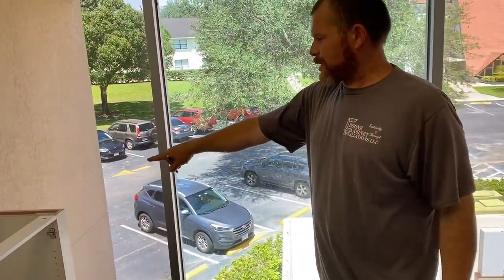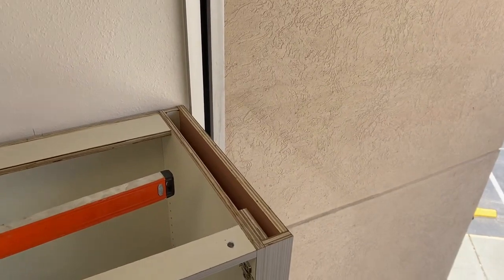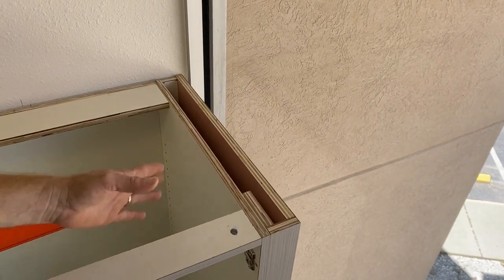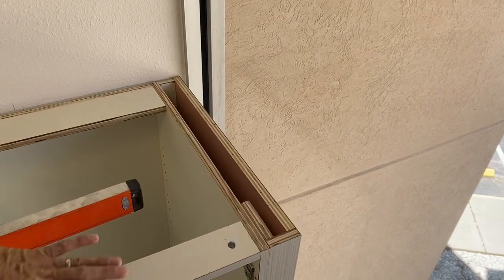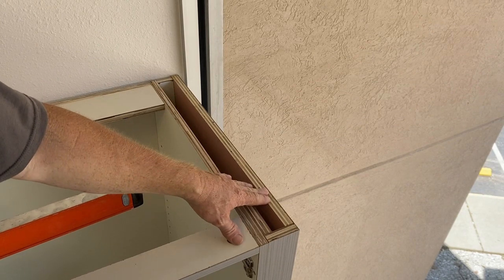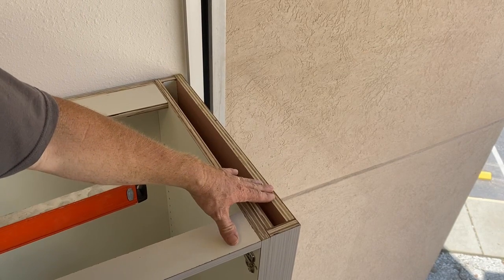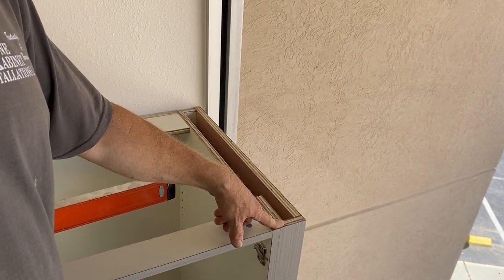If you zoom in to the top, it gives them a little better idea of how that thing's constructed. The majority of it's scrap material because you're laminating it. When you're cutting the sides of your cabinets, if you find any drop material that is within 23 1/4, which this one was, you can just add a piece to the front, making the depth of your cabinet.